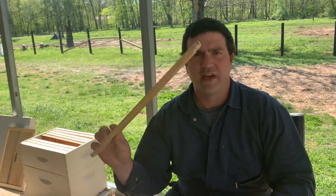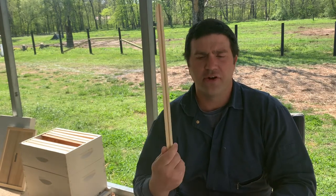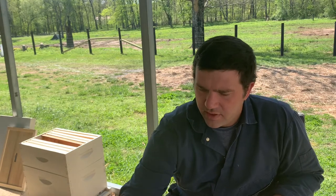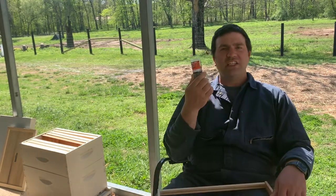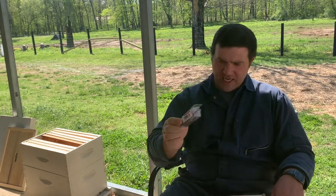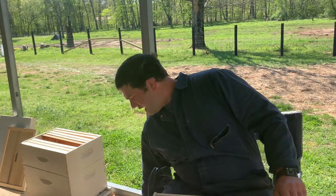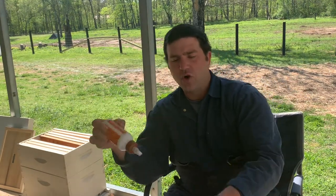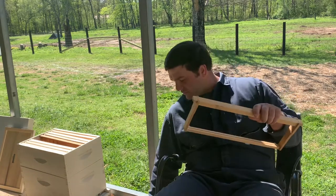We're still a couple steps away from that. Right now we're building it — we have just these raw pieces: the top, the bottom, and two sides for each one. We've got a cat paw here for general use, some one-inch 18-gauge nails, and some wood glue. What we're going to do is glue our corners and then run some nails. There are several different ways to do this, but the way we're going to do it is with the nails.